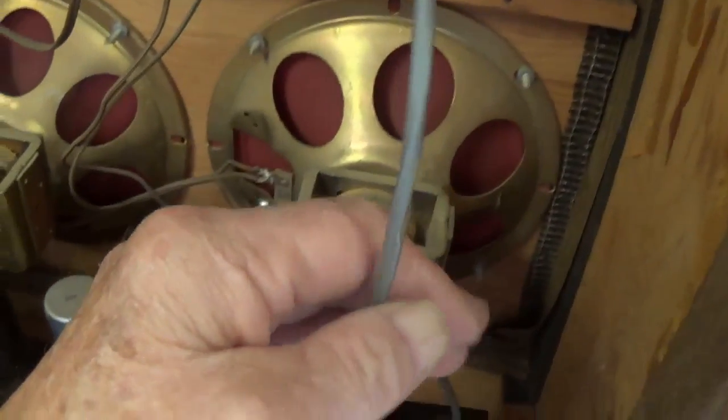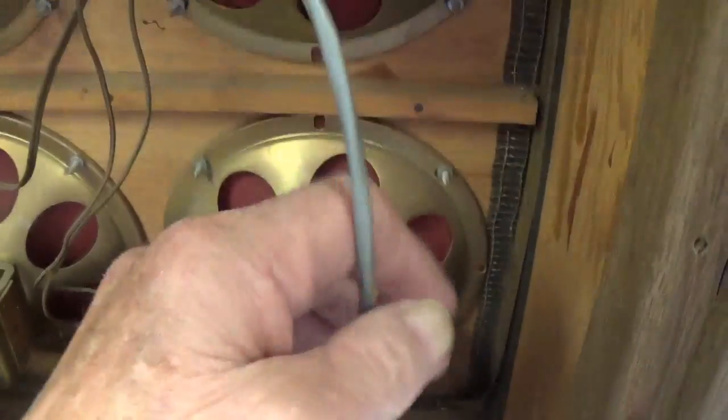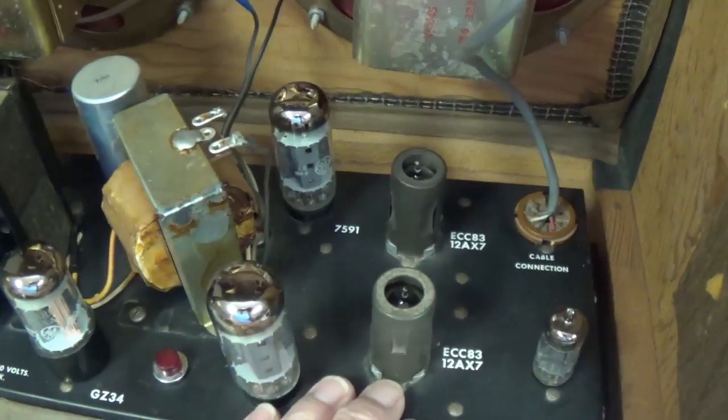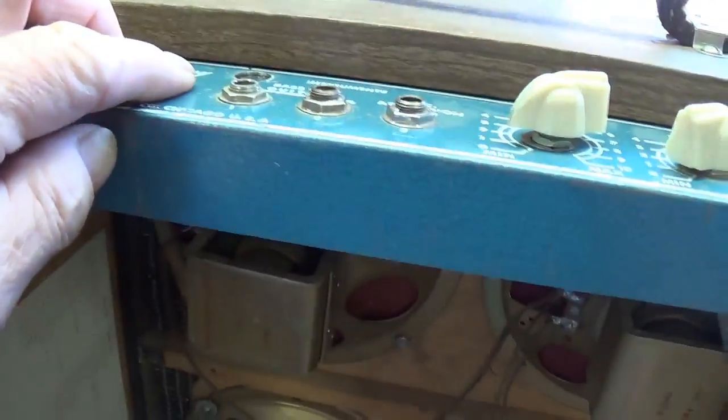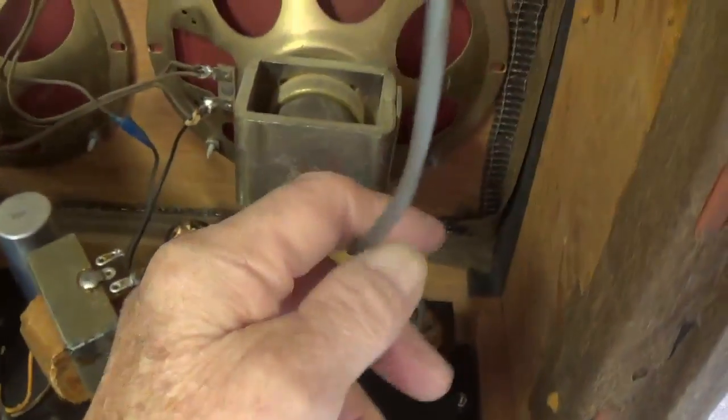Another big issue is this, because it's carrying signal, is a shielded cable. Because of the different potential between the control panel and the chassis, there was a huge ground loop formed through the shielding of the cable. Okay, it was an inescapable source of hum. So by transplanting the toggle switch and neon, so no 120 volts is up here, I eliminated the ground loop and eliminated the source of hum in the control panel.